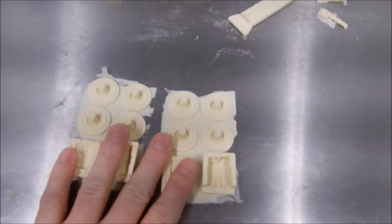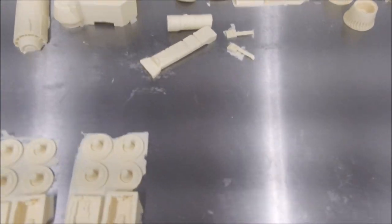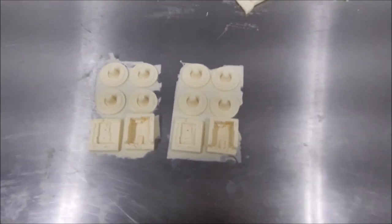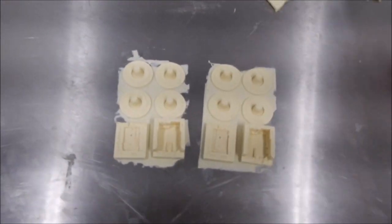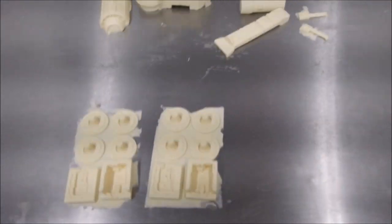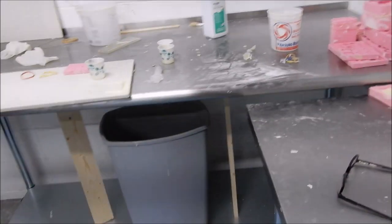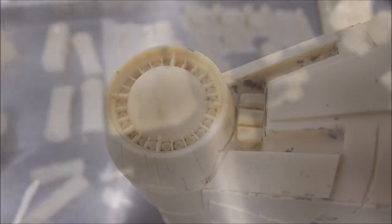These here are going to make four sets of these. These are for the clear parts because since the clear parts take so long to cure — about three times as longer — I do four sets at a time. I don't have to spend so much time waiting for the clear parts to cure. So another set of these to cast over there, and then that'll be ready to do today.